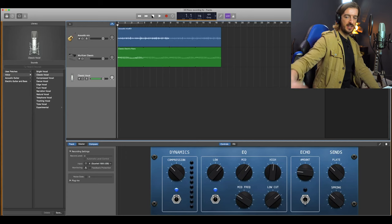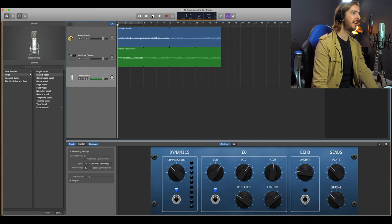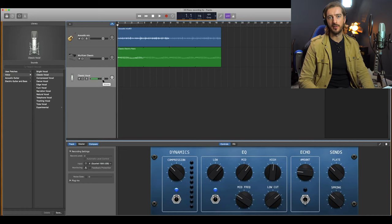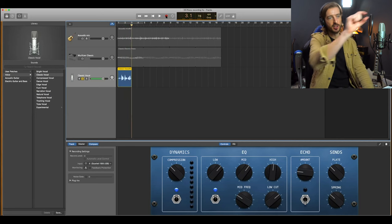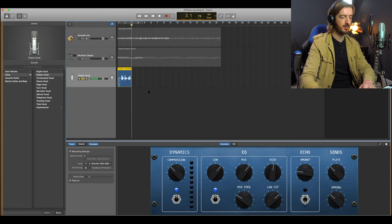I'm going to jump on headphones. As we've said previously, if I'm hearing the sound while recording from the speakers, the microphone's going to pick it up as well. One thing I'm going to have to do before I start singing is check the gain - I'll sing a little bit of the song. It's a little hot, so I'll turn it down. You can see on the metering we're just hitting the yellows but pretty much all in green, and I'm nowhere near the reds on the Focusrite - that's what we want. That is a good signal level. If that was spiking, it would sound distorted.